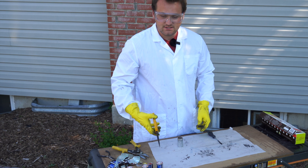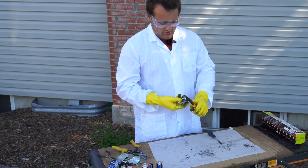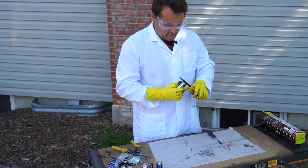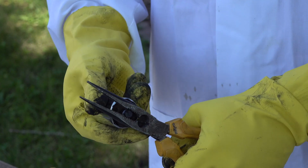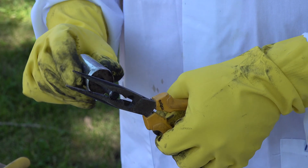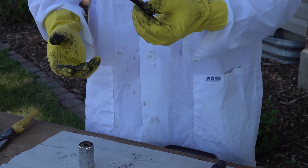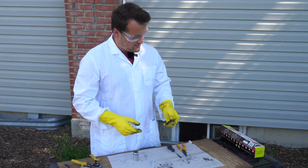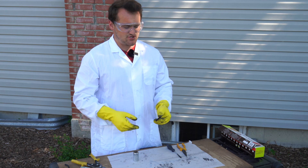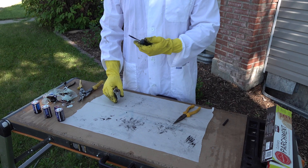From here you are going to get your needle nose pliers and you are going to gently squeeze the carbon rod in the center. Basically you just want to rotate it and gently pull it out of the casing. This here is a carbon rod — this is the carbon of the zinc carbon battery. Its purpose is basically just to act as an electrical connector for the inner components to the positive terminal. It's useful for a bunch of things, but for now we are just going to set it aside.